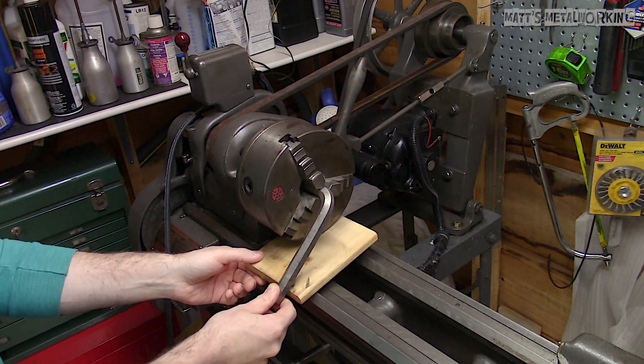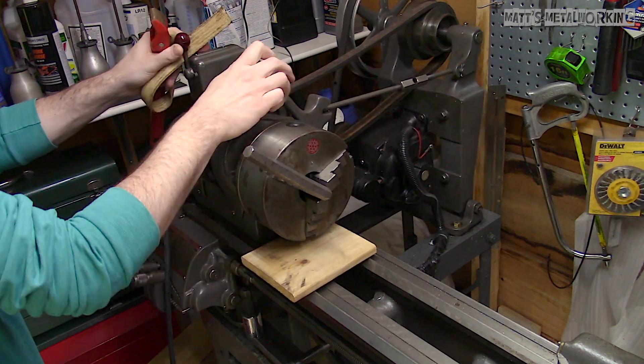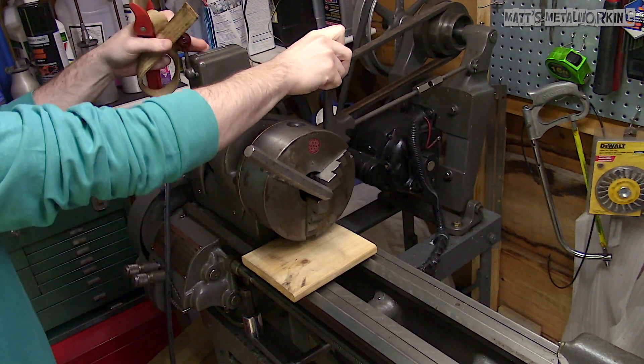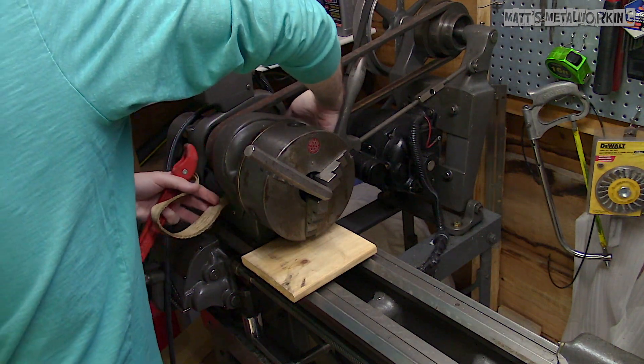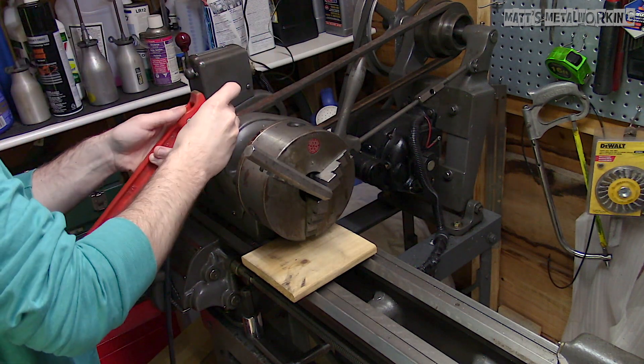Also make sure the drive is engaged to provide a little more resistance. Using a strap wrench, wrap it around the pulley on the headstock. With this model, a South Bend, the gears can lock; however, it's not intended to be used for such a task, as doing so can risk breaking the gears and it can be hard to find a replacement, beyond having downtime on your lathe.